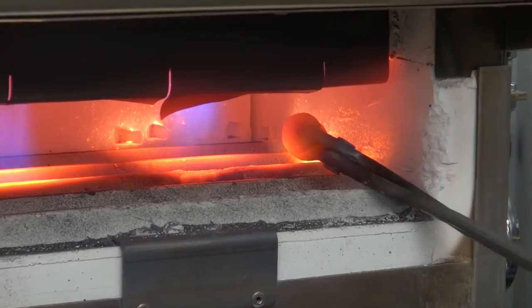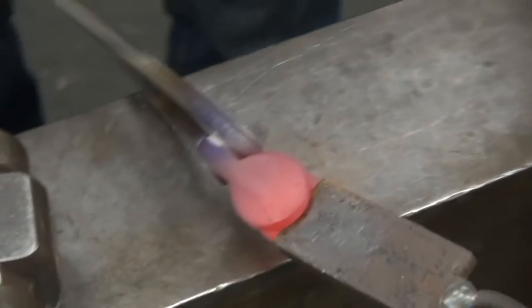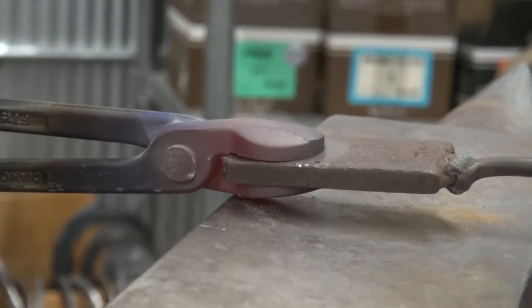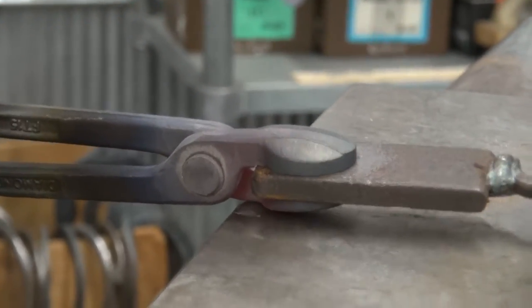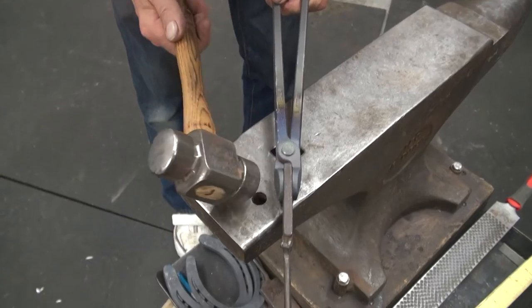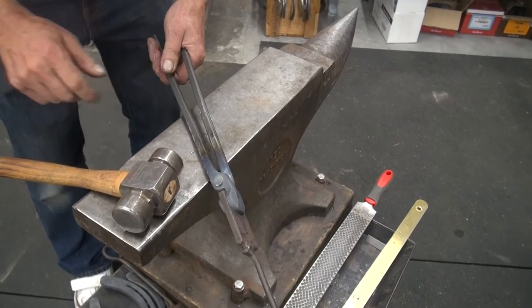Here we go. We'll come out. I have a piece of 5/16ths that's on a stick — makes it kind of handy. Put that in there. I just want just the jaw on the anvil. I'm just going to tap it. Flip it over. Tap a little bit on that side. Now we've closed up those gaps we had in the back, and the reins are still a little bit apart, but we've got it set for 5/16ths. I'll come back in here and make an adjustment as well.